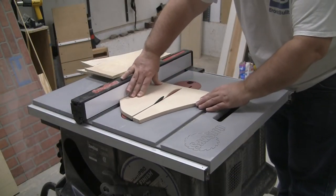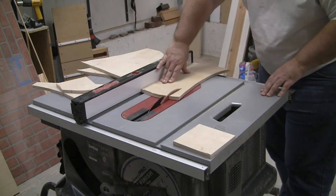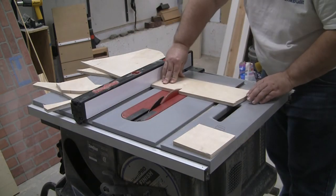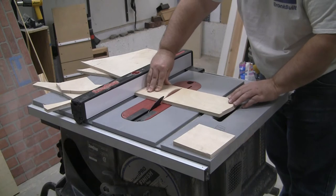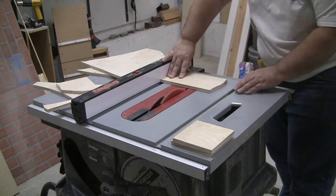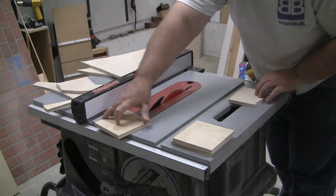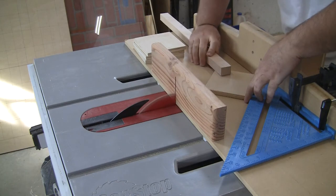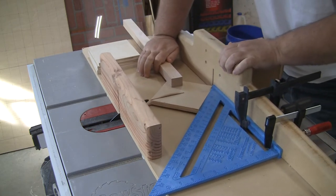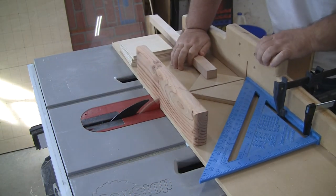Pegs will not work on the halfway marks on the very sides of the board — the disc would simply get stuck between those pegs and the sides of the board. To fix this, I'll use small triangles that will push the disc back into play. I need 8 triangles, so I'll get that by cutting four 4-inch squares in half diagonally. I start by making the 4-inch squares out of scrap half-inch plywood, then use my table saw sled to cut them in half — not the most elegant, but it works just fine.